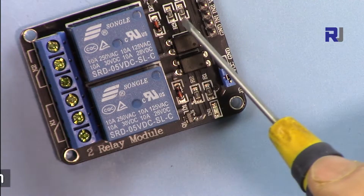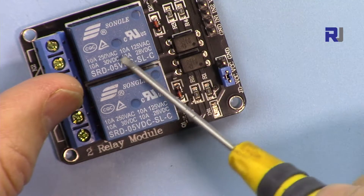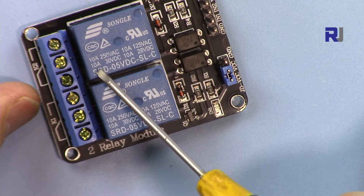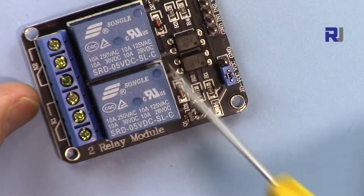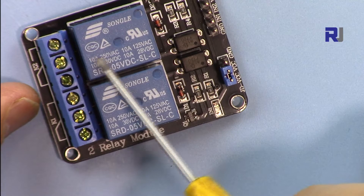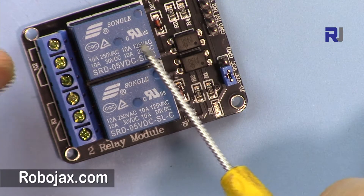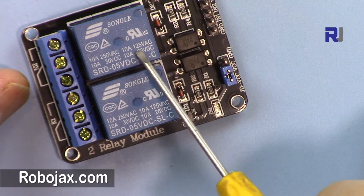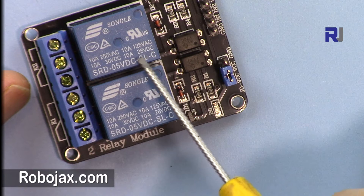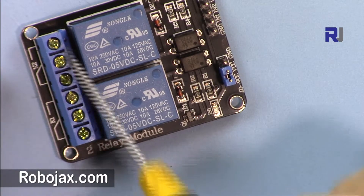About the rating — which many people miss — you cannot switch a heavy load. If you are in Asia or Europe using 240 volts, it cannot be more than 2.5 kilowatts. The relay contact can handle up to 10 amperes: at 250V that is 2500 watts, and at 120V (North America) that is 1200 watts. For DC at lower voltages like 26–30 volts, it will handle about 280–300 watts. More than that may cause the contact to melt down or malfunction.